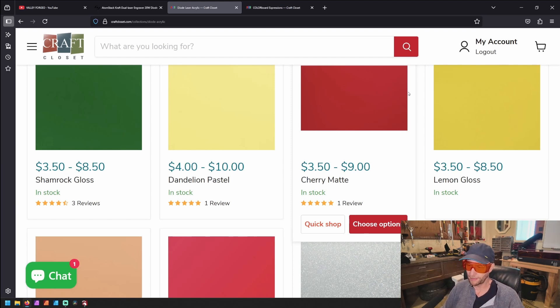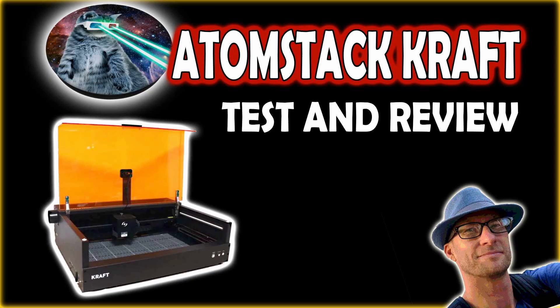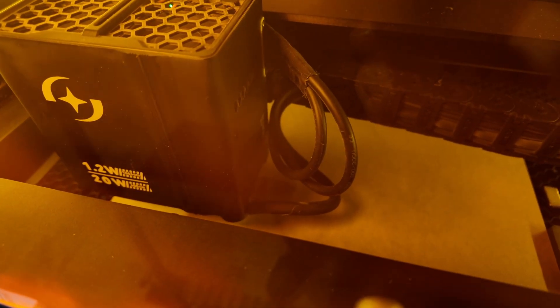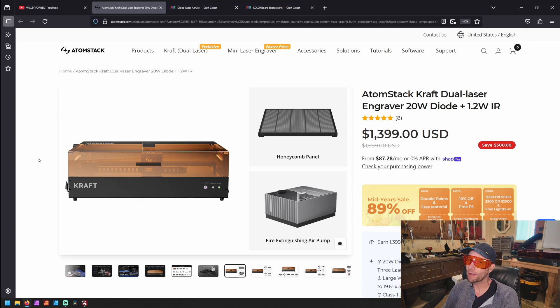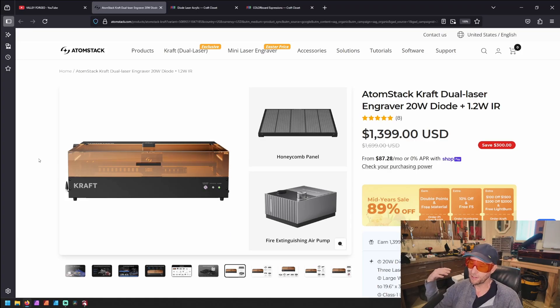I saved a little money for you, I think. Speaking about the laser I used: I used the Atomstack Craft 20 Watt. So you have to gauge your laser based on that. This is a fantastic 20 Watt laser — link below, of course. If you have a 10 Watt machine, you might struggle with a lot of diode laser acrylics. The ones that say fantastic will probably be your best bet if you have a 10 Watt or below. Everything here is my opinion and my testing. If you have a 30 or 40 Watt laser, or even the Atomstack 70, it's going to be different for you. The ones that say 'okay' will probably work very well — you'll probably have to take one less pass or whatever than I did.